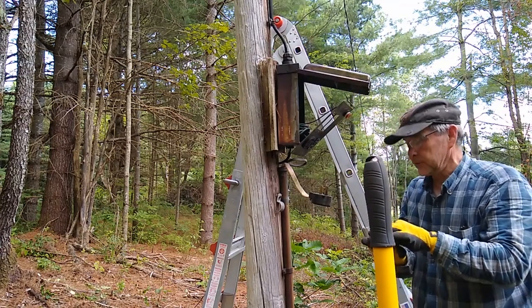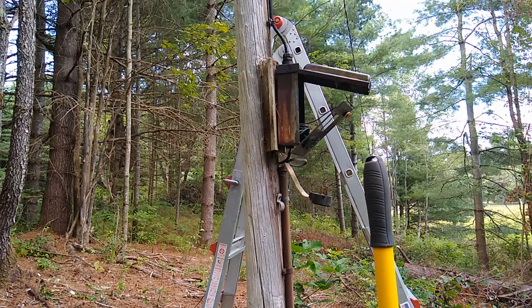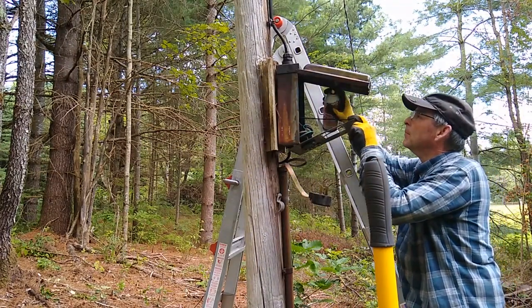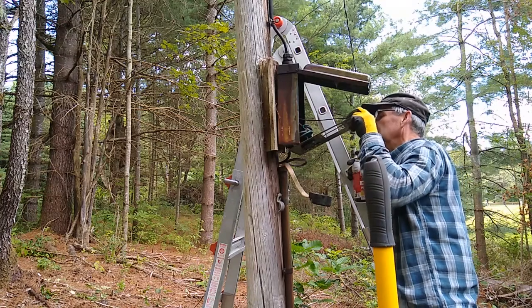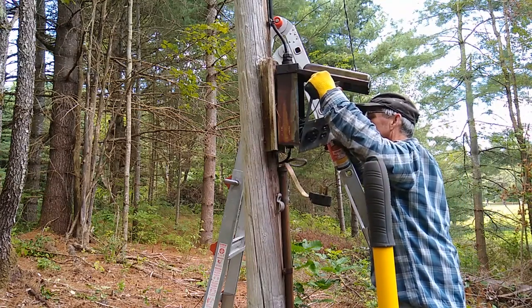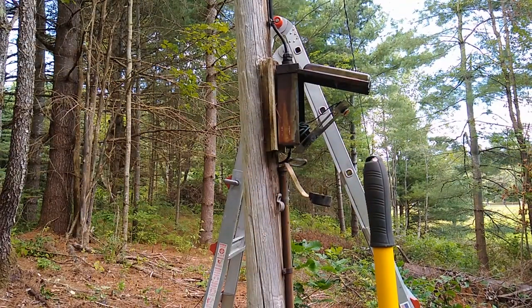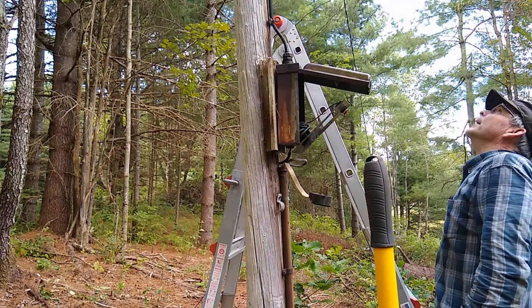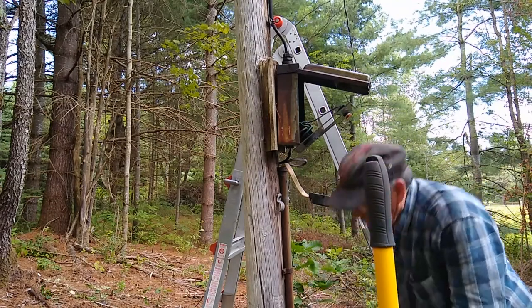You know what, I'm going to get some more blaster for inside here. Looks like there's some corrosion in there. Hit the blaster, will help. That way I don't have to cut any cables. I think my cable lengths are probably about perfect for the existing new box. I'm going to be able to reuse the wire, underground wire going to the jet pump, and utilize the wire coming down from the tie-in up top. Alright, let's see if we can loosen up some.